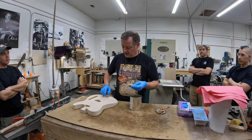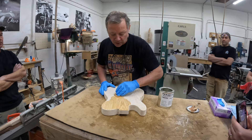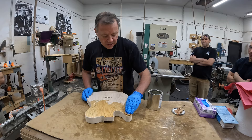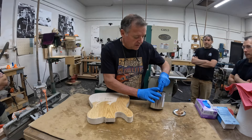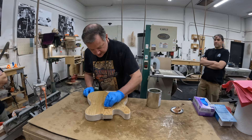You take it out and you just kind of mash it in. I don't want to fill all my holes with it — we can do that after we do pore filler. And when you're doing around these areas, I've got Q-tips so we can clean them out. You don't want to just go up close to it — you want to actually do it just as well there.